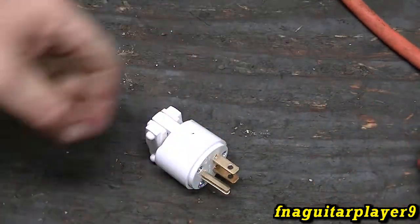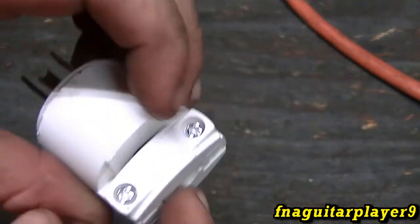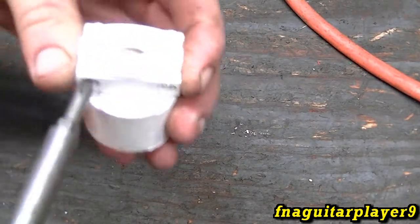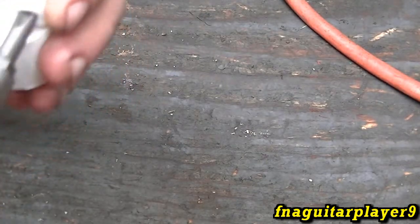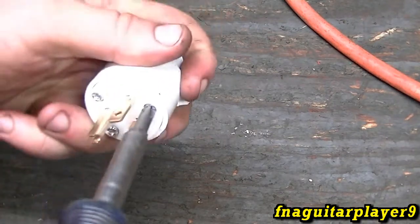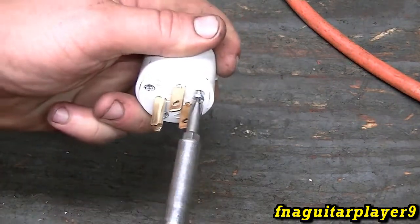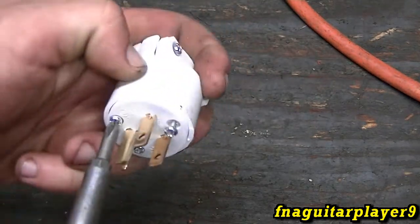You want to cut that off like that. Now if you look here, you've got three screws here and two screws here for your clamp. Go ahead and loosen the clamp screws just to get that out of the way — you'll see why in a minute. This is a critical step, it'll save you some aggravation. Then go ahead and take all three of these screws out completely.